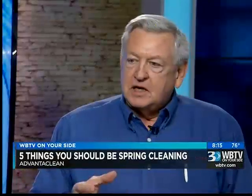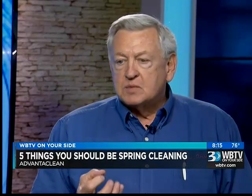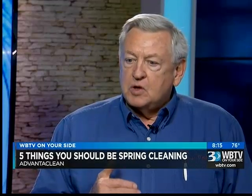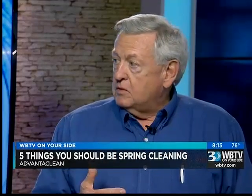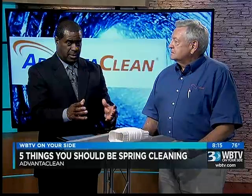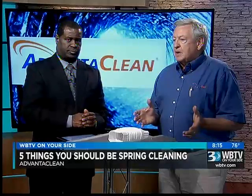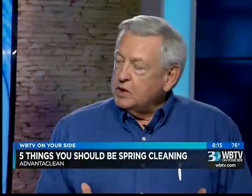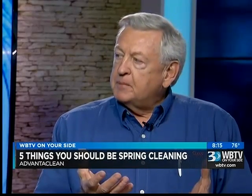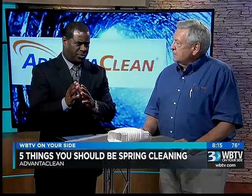Airflow is really key. Once humidity gets in, the wood gets damp and absorbs moisture. That airflow helps to dry it. You want to keep the moisture in the wood low, or you get mold growth. Right, and nobody wants that. No. Nobody has time for that. And then you have the standing water, also mosquitoes and things of that nature. It gets stagnant, it smells, has bacteria, and a house breathes from the bottom up. So what's in the crawl space has a tendency to migrate up into the house. And it can affect air quality and health as well, right?